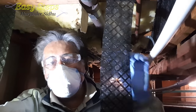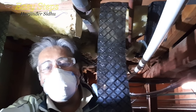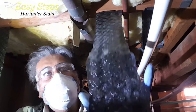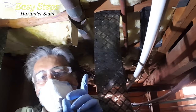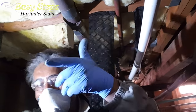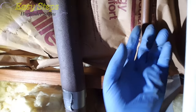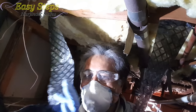As I started the first piece, it took me a little time, then I gave thought to what is the easiest and best way to do it. So here are the tips: you use your stapler and staple one side. Then you take this netting on the other side at the 48-inch mark and staple it. You're now covered with two portions of insulation. On this side, just staple it and let it hang — don't staple the other side. Now you flip it over. Once flipped, this netting will hold the insulation so it doesn't fall down. All the papers are stapled — that's why insulation stays in place.